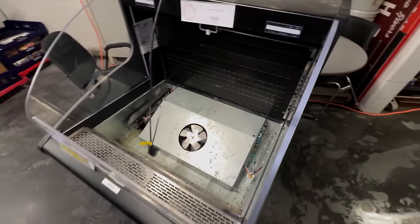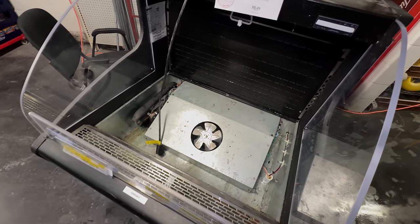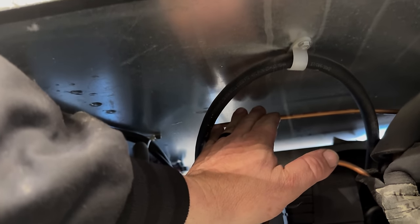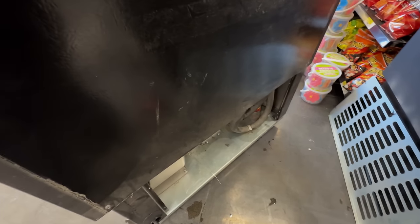Let's go ahead and run it and see what happens — see if it shuts off, see if it cycles on and off. Worst case scenario, we have to let it go. Maybe it's a refrigerant issue. We just got it plugged in. I'm feeling the discharge — it's pretty hot. I don't like to hold on to it, so I know we're pumping some heat. We do have a suction port on the back; the suction line's not really cold per se. It might be just a touch low. Never reaching temperature until it finally freezes up.